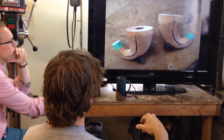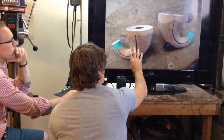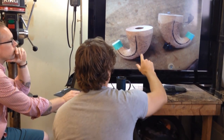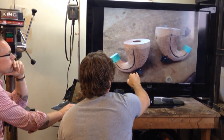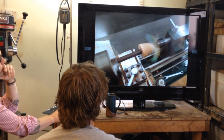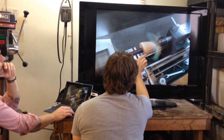That's something I'm going to begin doing. Had I drilled these originally on a lathe with a block clamped down, this whole step wouldn't be necessary. What I'm doing is taking this and putting a mandrel in, and then I have something for my tailstock to line into. I set this on the lathe and then it gets a little weird.